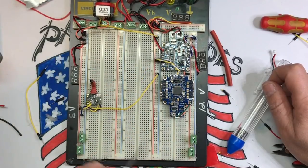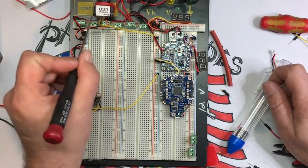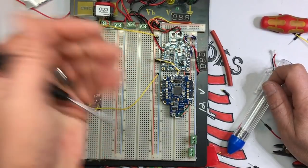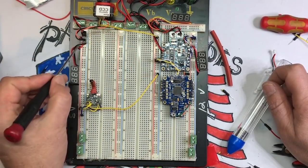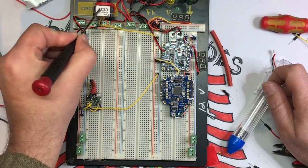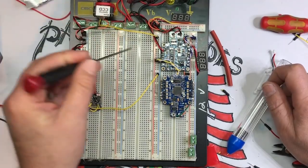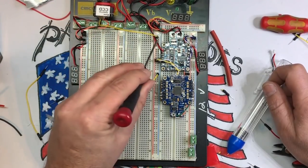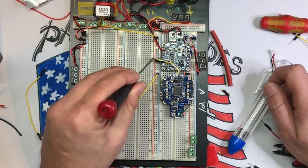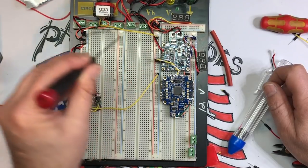Now remember that. Okay. Then I took my camera and I soldered three wires into the back, or you can splice them if it's easier. And two of those go to the 5-volt terminal, which is over here. That's always going to be powering this camera. And the other one, which is our video, which would be video in, I'm plugging right into this bar. See, that connects it with the video in right here because all these have continuity and all these have continuity.